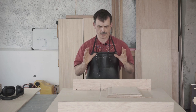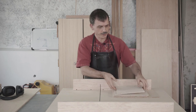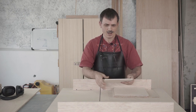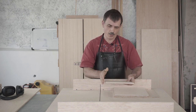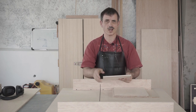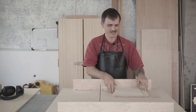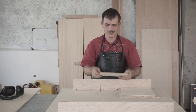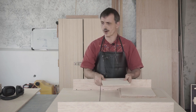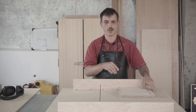Okay, so I just want to explain something very important at this moment. I've cut the basic squares for those brackets to length. It's important at this point that I get the edges and the sides at exactly 90 degrees. So I'm going to re-cut, starting with one edge, both sides and the opposite, to make sure they're absolutely square. I'll be checking them with a square as I go along.